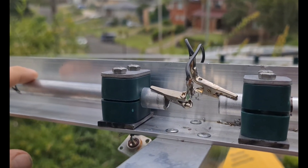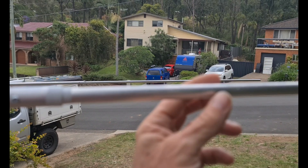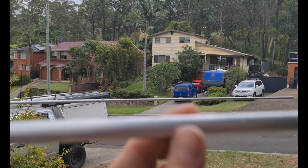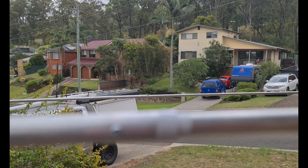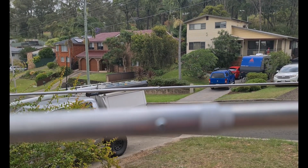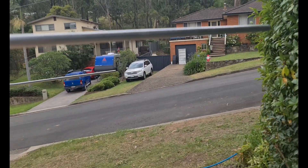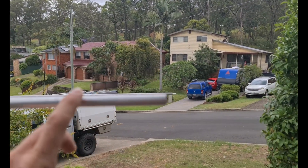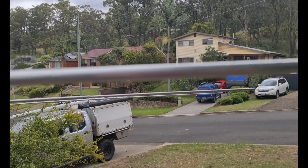On the elements I've got alligator clips — the center pin on the right and the outer braid on the left. To get the band resonant, I slid the outer rail — I've got 14 mm outer with a 12 mm inner, 1.6 mm wall thickness. Both lengths are measured equal. The best SWR I initially got at 28,500 was 1.6 to 1.7:1, with about 2:1 at the band edges. When I looked down the antenna I found the driven element was inside the director, so I shortened the director by about two inches either side and ended up with the final SWR curve.